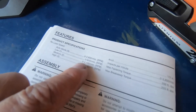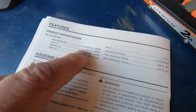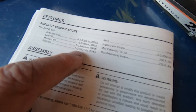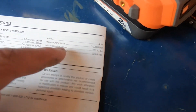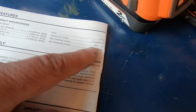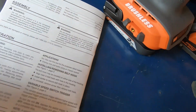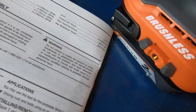The specs: in auto mode 2800 RPM, low 850, medium 2100, and high 2800. Impacts per minute is 3800. The fastening torque is 200 foot-pounds and the breakaway torque is 225 foot-pounds. Those numbers are the same for both the three-eighths and the half-inch versions.